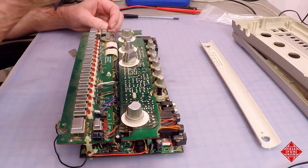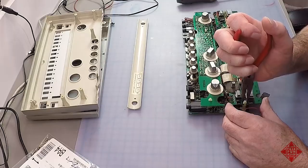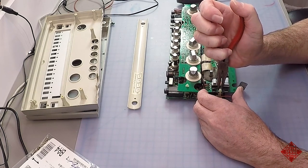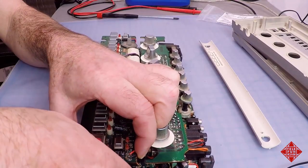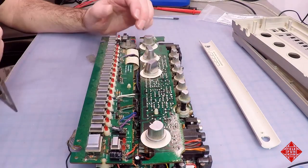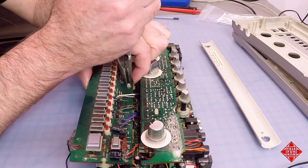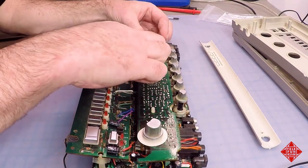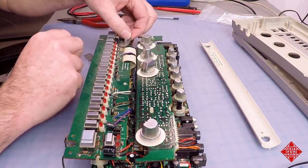And the way we take the instrument apart, because we're going to need to in order to do some probing around the circuitry and also want to do a thorough inspection, is we gently compress these fittings until they release the board, these standoffs. And again, gentle is the word, and they should just sort of pop right off. We don't want to be too rigorous with this board because, amongst other things, this thin ribbon cable is prone to cracking, breaking, and then sometimes you have connectivity issues that will manifest and affect your ability to use the instrument.